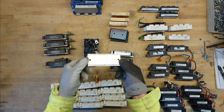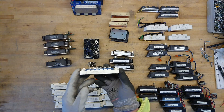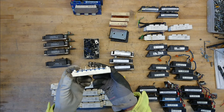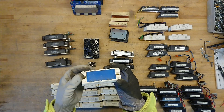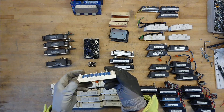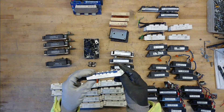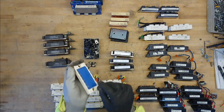Another thing that's a little irritating is three-phase bricks. Inside here you have three half-bridges sitting in a three-phase full-bridge configuration. What I imagine I could use these for — since they have no internal protection unit, just gate drives and DC bus input with three outputs — is to use all three phases in parallel. You could look at this as a 150 amp brick, or maybe 100 amp. You can't always just double up when paralleling IGBTs, but here they are so close on the same die and same heatsink that temperature differences shouldn't exist, so current conduction and losses should be the same for all dies inside the module.